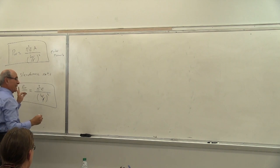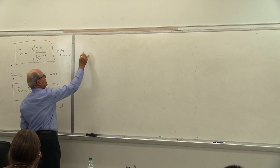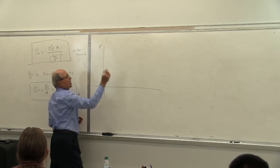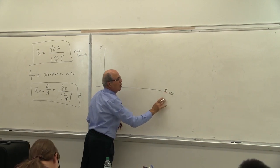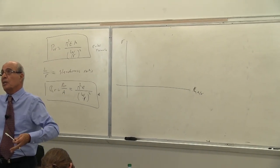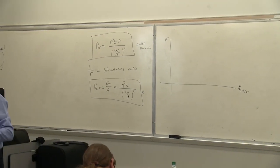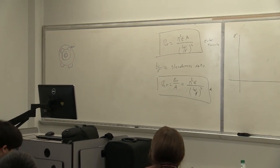However, what was said at the end, if I use L effective, now I can plot it in this equation. If I plot the equation of sigma, I'm plotting sigma versus LE over r. Is that understood? That LE over r is the slenderness ratio of the column. Not necessarily, if a column is tall but very heavy, it's not as slender. Everybody understand? Because I consider both the length and the moment of inertia of the cross section.